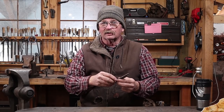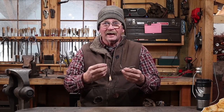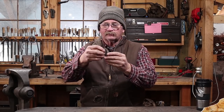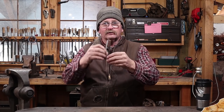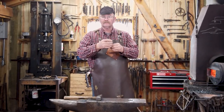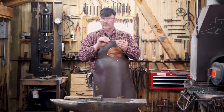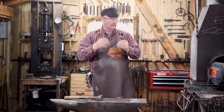But everybody really likes the Hook of the Week and I'm getting to the point I kind of like the challenge of doing something a little bit different. Just doing a couple of J hooks isn't much of a challenge. So let's see if we can do something a little different with these two pieces and make some sort of an interlocking hook — one piece wraps around the other and becomes the hook, and one side's the hanger. I'm going to flatten both ends out: one end for mounting holes to the wall, and the other end I'll round up so the two pieces connect and intertwine.